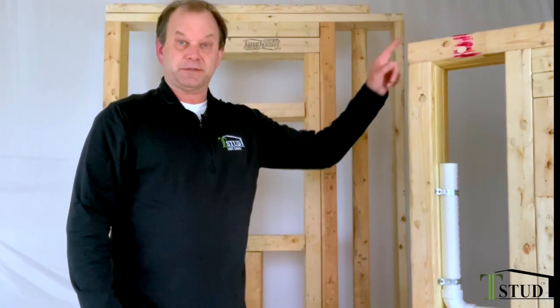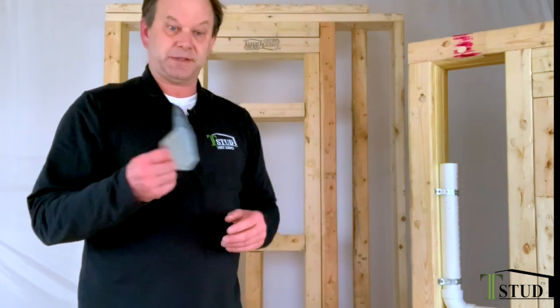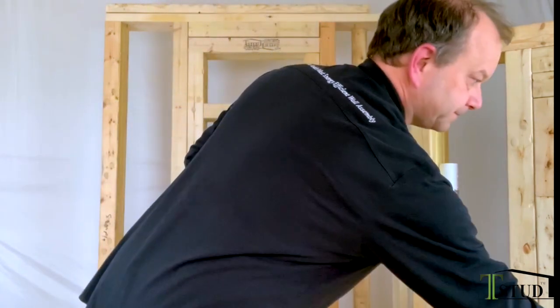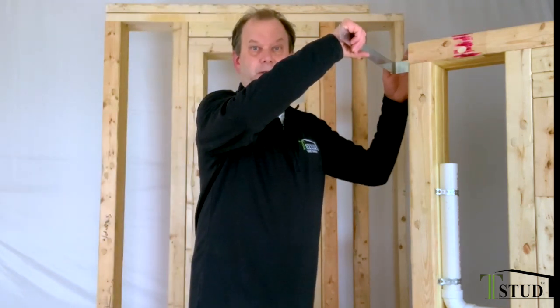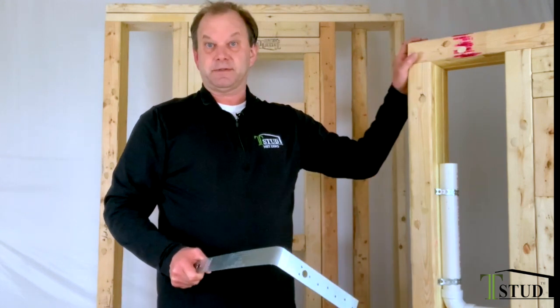If you're using the T-Stud for the top plate, there are a couple of fasteners you have to be aware of. This one right here is an RTA-2Z — a Simpson product. This is an inside connector — it fastens onto the inside. But the outside one is where the strength comes in: the standard strap, nine fasteners one way and nine the other. Put it on the outside to hold your whole wall assembly together — that's how you hold your top plate together because you only get one top plate. If you're doing advanced framing with just a single two by six, you have to line up all your studs all the way across. When you're using a T-Stud, you don't have to line them up — you can go as much as five inches one way or the other from the stud in case you make a mistake with your truss layout. This is the connector you have to use to hold your top and bottom plate together, and obviously a standard uplift connector to hold down your trusses.